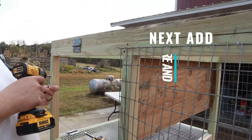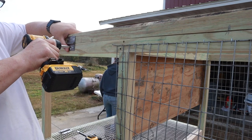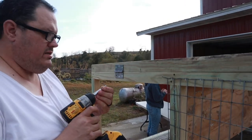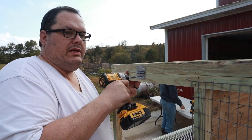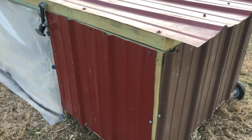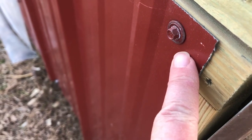Here we're putting in some hinges. You want to use wood screws for this and not just any old screw — usually if you buy a good set of hinges they come with screws. For outdoor use, you definitely want stainless for the longest life, though it's the most expensive, or galvanized, also called zinc-plated. Then we add the metal to the sides and back of the tractor. We're using screws specifically designed for metal siding or metal roofing — they have a little rubber piece that gives it a good seal so you don't have any leakage into the tractor.